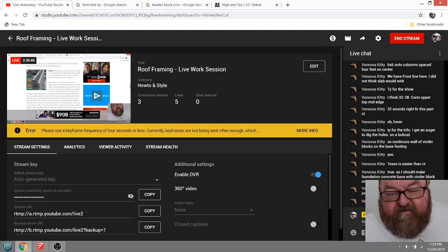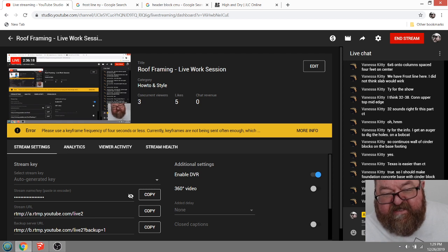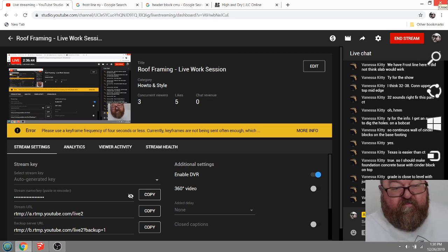that would be in New York, I would do that. I would use a spread footing, 32 inches deep, come up with regular block until the top course, and use a header block on top. We call them shoulder block, header block. But in Texas, I would just do a turndown slab, that's what we do here. We dig a footing that's only about 12 inches deep and 16 inches wide, and then we form it up. And then when you get up above the footing level, the slab just becomes the width it normally would. But I could show you a different detail for Texas than for New York, and probably save yourself a lot of grief.